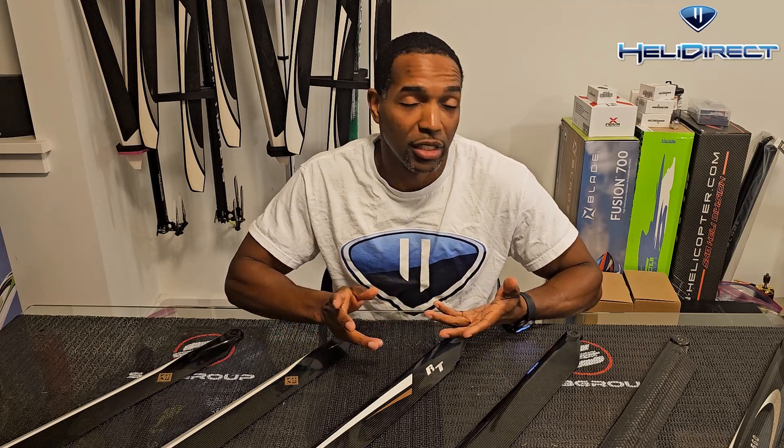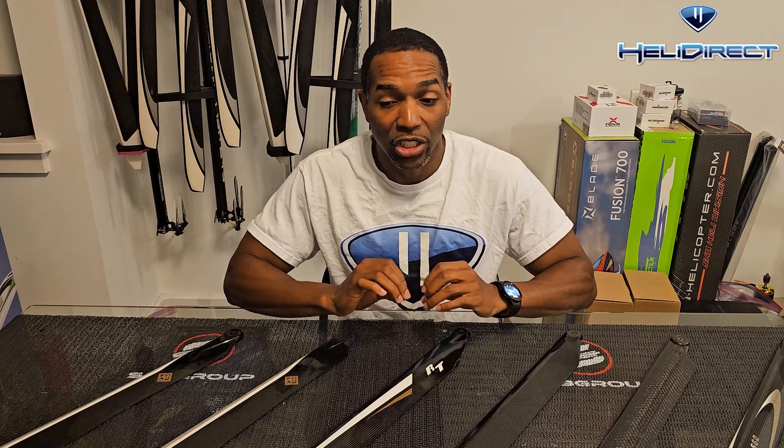Let's start with the obvious. Most blades today have a safety wire running the length of the blade. First and foremost, if you are able to see that wire, the blade is done — chances are it's broken and flopping around, and you're not flying that blade. The purpose of the safety wire is to prevent the blade from breaking apart into multiple separate pieces. Again, if you're able to see the safety wire or the foam core inside the blade, the blade is done.